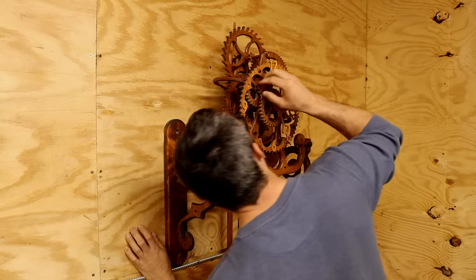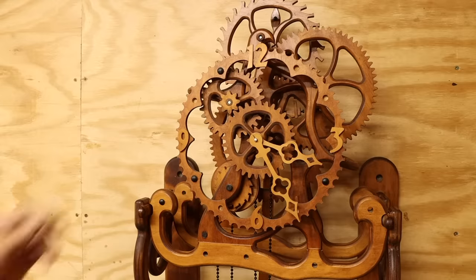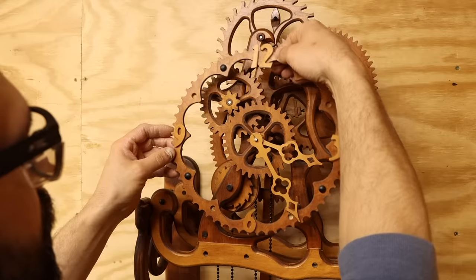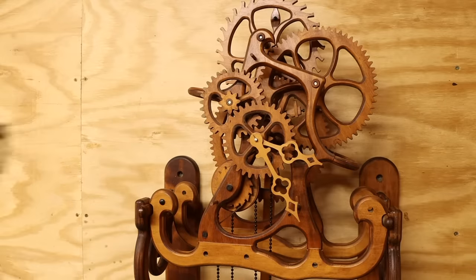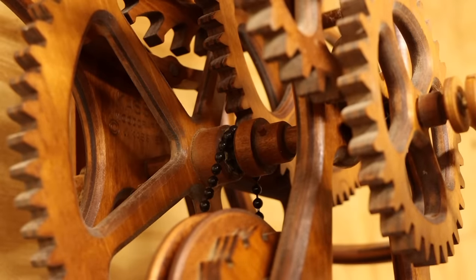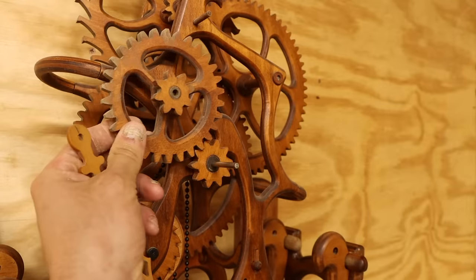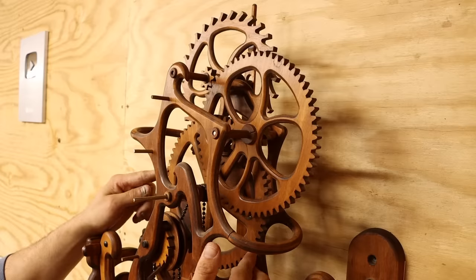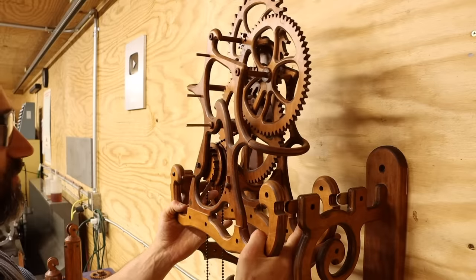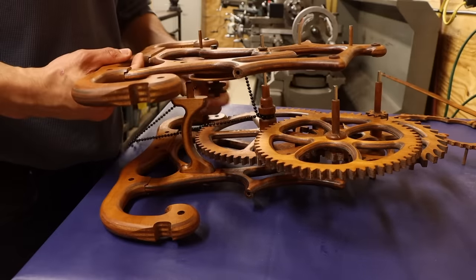To make sense of those problems, I should explain what some of these pieces are from my novice's perspective. Most of the showy stuff on the front isn't all that complicated — it's mostly gears to get the drive ratios needed for the different parts of the clock. The main shaft running through the center is driven by a sprocket and chain from which a weight hangs and spins the clock as it drops. The front set of gears is a reduction drive for the clock's hands and works just fine. The back of the clock, though, has a larger set of gears, and those don't work so fine — I seem to be losing power somewhere in this gear train, either from binding or too much friction in the shafts.